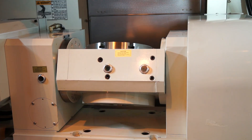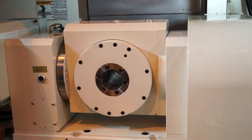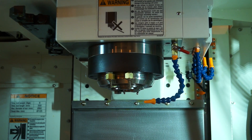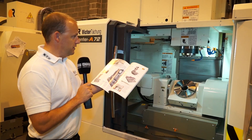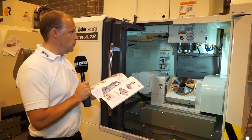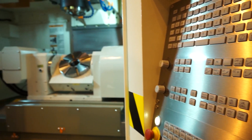It's a quick machine. It moves on linear rollers. It is a cast base and it comes with a 12,000 RPM direct drive spindle. There is an option for 15,000 RPM — in fact, this particular machine has a 15,000 RPM spindle. It's oil cooled, which you would expect when you're looking to machine to the optimum in precision.